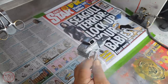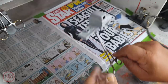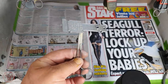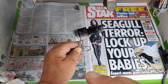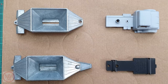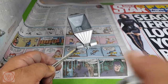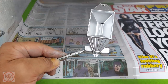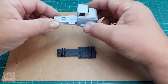The first time around I didn't prime the hoppers — I thought they're going to be silver anyway, does it really need priming? The paint didn't go on particularly well, so I ended up having to strip the hoppers a second time, undercoating them, and then using my airbrush to paint them silver. This Australian export silver paint is a really good product, but today it went on a bit lumpy and rough. Overall I was not impressed by the finish, so I decided to strip it back, prime it, and redo it with the air gun.